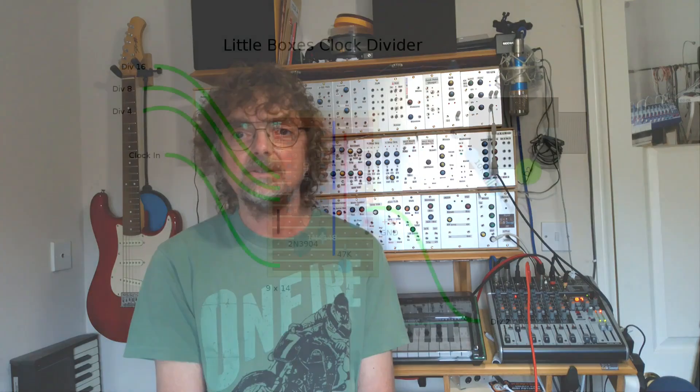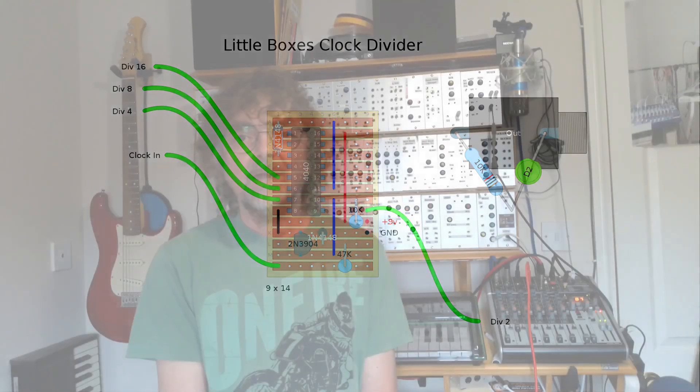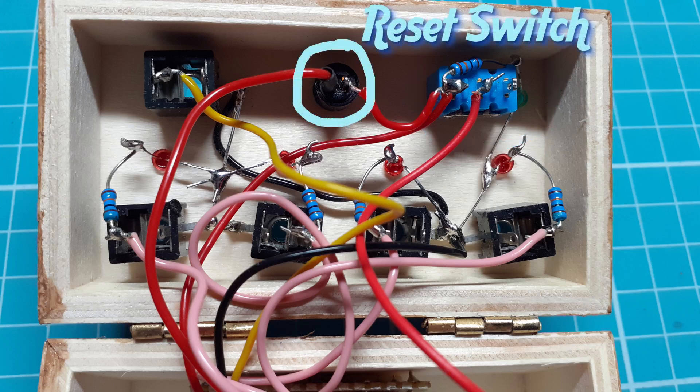So what does it look like when you put it on stripboard? Well it looks like this. The stripboard is very simple because there's not a lot there. When you put it in the box, a lot of the wiring actually takes place in the lid of the box. You can see there's the tiny circuit in there with the battery, and in the lid of the box I've wired in the LEDs to tell me which gates are open — an LED and a resistor between the output and ground for each of the outputs. And because it's battery-powered, my usual little boxes approach: you put an on/off switch and a power indicator so you don't forget and your batteries go flat.